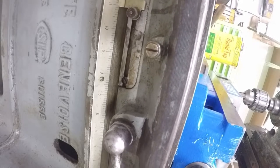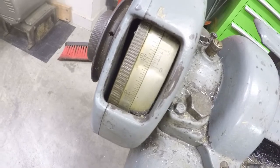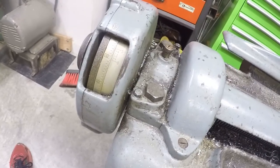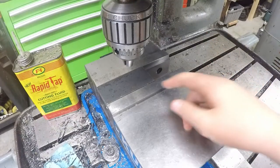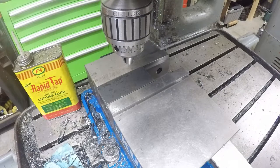I'm going to move it over to exactly 12 inches in my case, because we start at 10 — that's the zero of the edge of the vise. So I'm going to move over to 12 inches. We're getting close. Each of these marks, I believe, is 10 thousandths, so a full revolution is going to be 100 thousandths. We're going to go to zero because we're going to exactly two inches. Now we're at two inches — we are exactly two inches on our part, and that's where our first hole needs to be. We need to raise up our head because we're a little low and cannot get our drill bit in there, so I'm going to raise up the head.